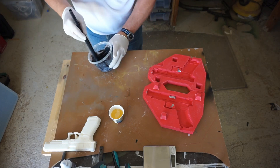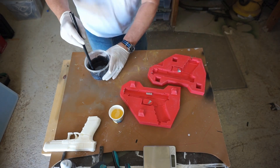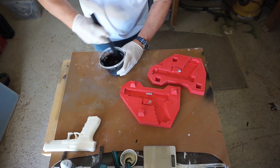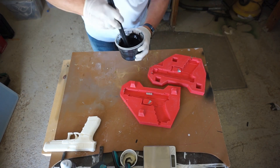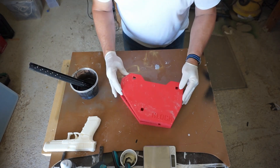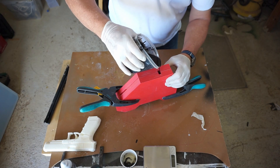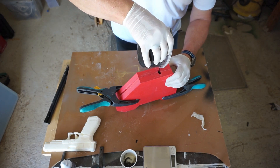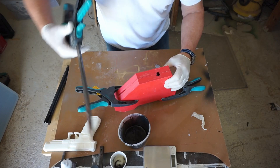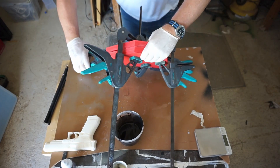Making sure the black is completely mixed in. The moment we pour the second component in — now I have about 30 seconds of pot life, so I have to hurry up. From the first test with the white gun underneath, the trigger guard was not completely filled, so first I'm filling in the trigger guard a little bit. Now I really have to hurry up — clamping it quickly, pouring in the rest of the polyurethane material, clamping up some more, and waiting two hours until it's cured.